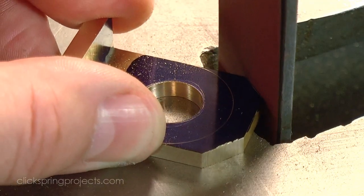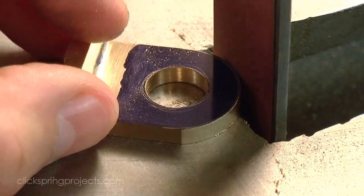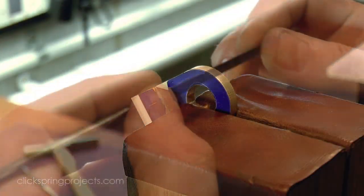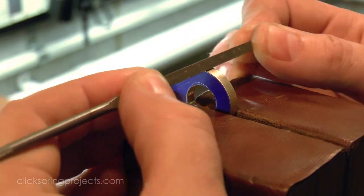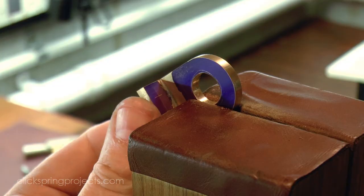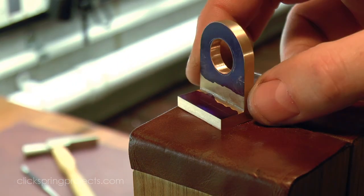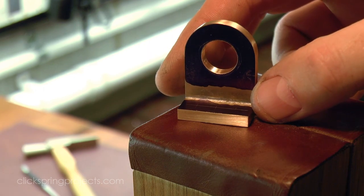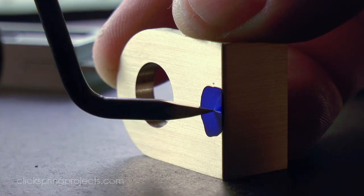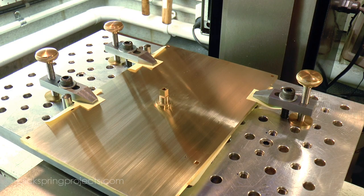The wheel assembly could be held up to B1 with a toolmaker's clamp, depth, marked and then permanently fixed in place. But I'd also like to have the back surface of the bracket flush with the side of the main plate without having to trim that plate after the fact. So that meant making my best guess at the correct depthing at the planning stage, and essentially locking it in at the start of the project. It was a riskier approach, no doubt about it, and as it happens, it worked out fine, but I'll be taking a more traditional approach with the depthing for the rest of the mechanism.